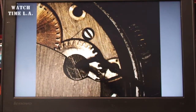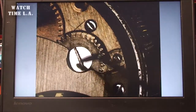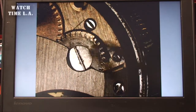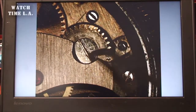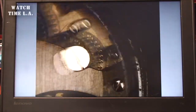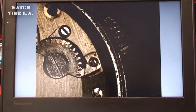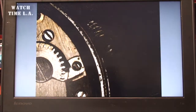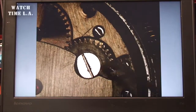What happened was apparently the guy cross-threaded it. When I started screwing it in, I thought I was cross-threading it, but it was going in way too easy for that. So the screw doesn't sit in there correctly, and because of that when you tighten it to the proper amount, it binds this wheel. So you have two choices: you can either have it set to a distance where the watch will wind, or you can adjust the time, but you can't do both. So I think that's when the guy gave up. But I wanted to see if I could get it to even work, so I put the screw in, wound the watch, and it ticks like a champ.